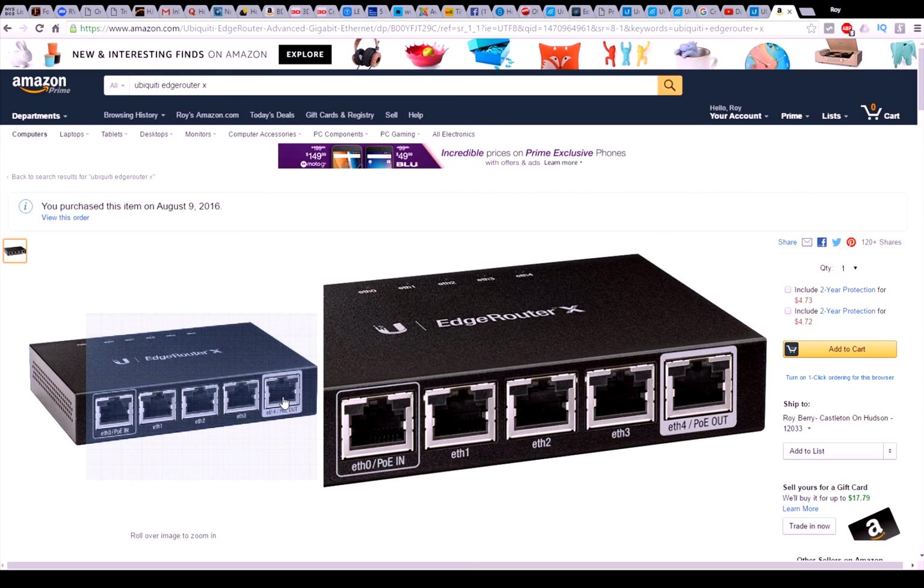You can also have it monitor that access point. So if you give that access point a static IP and it doesn't respond within X number of time, you can tell it to shut the power off to that port and then cut the power back on later on. And if that doesn't do it for you, obviously you're going to have to go out there and make a tech visit. But part of the reason I like all this gear so much is I can have this stuff basically drop shipped to the customer and then walk them through configuring it. And you just can't beat that.